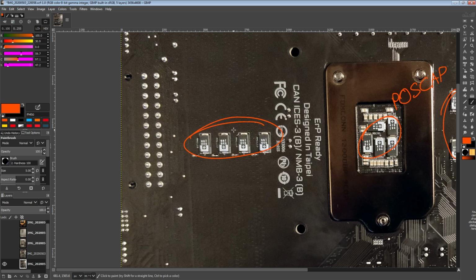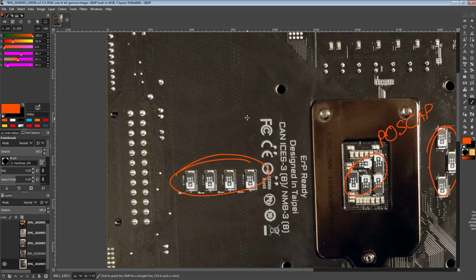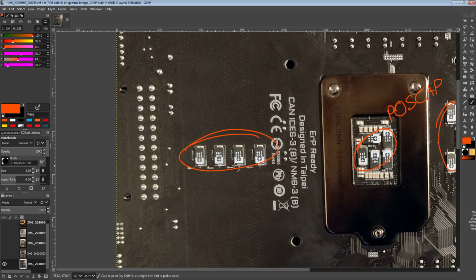But if you measure it from any of the larger capacitors that's just generally bypassing the entire memory stick, you don't see much of it anymore. And so I think doing this on the motherboard just isn't really going to do much of anything, because you just run into the issue of there is impedance between these capacitors and the actual memory chips that is far too great to be affected by the fact that now you have very low ESL, very low ESR capacitors added to the output filter of the memory VRM.